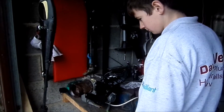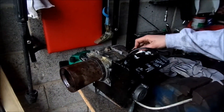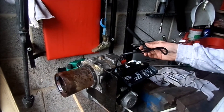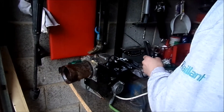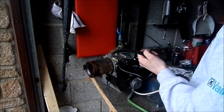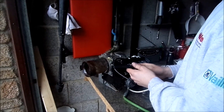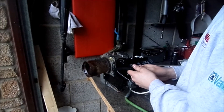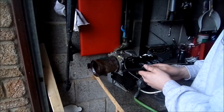We're going to be testing a photocell or magic eye on a pressure jet burner. First, we'll pull it out and fire up the burner with the magic eye exposed to the light. The burner shouldn't light because the magic eye has to see dark before it actually lights — that way it knows it's actually seeing light. As you can see, nothing's happening.